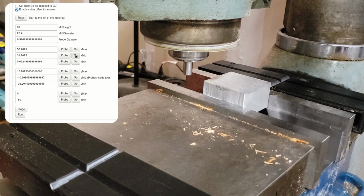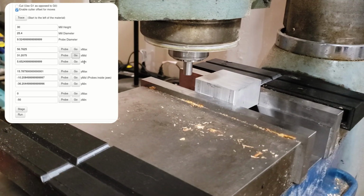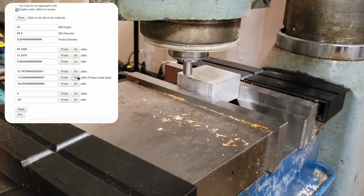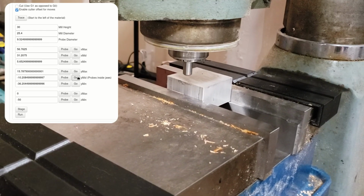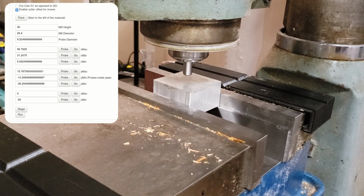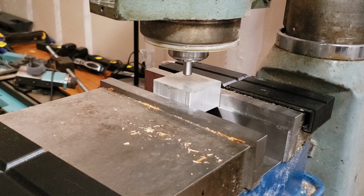here in this project. So now the last thing I want to do is just show that we can go and find the center of the piece as well, because we know where the sidewalls are, so it's pretty easy to find the middle. And this will help us set up the threaded hole in the middle of the block, which will help us put in that offset hole. We know that the offset hole on the T-nut that we're making is 2 millimeters off from the middle.